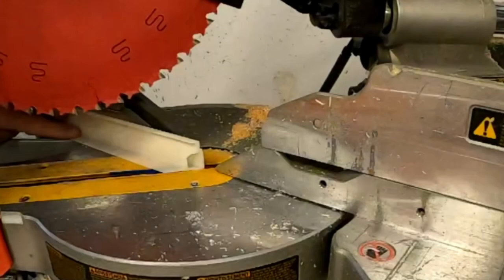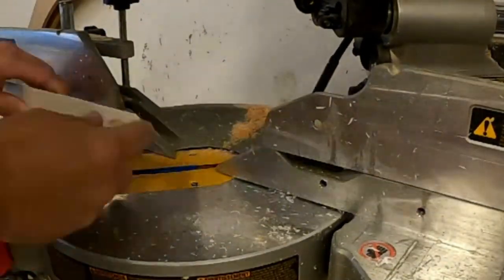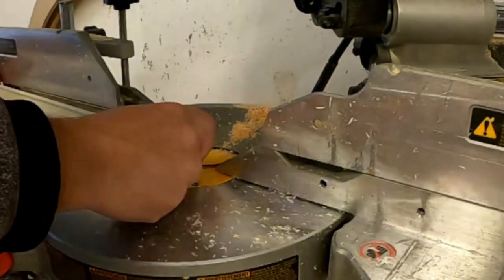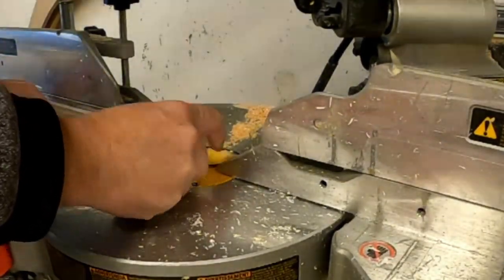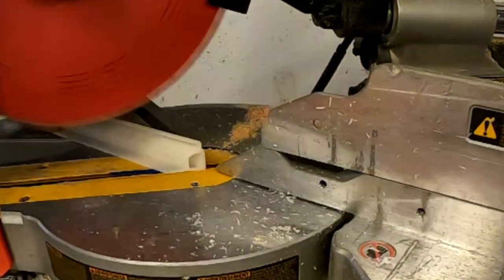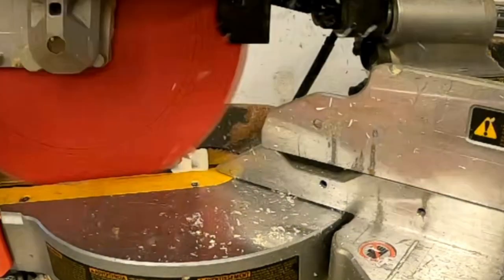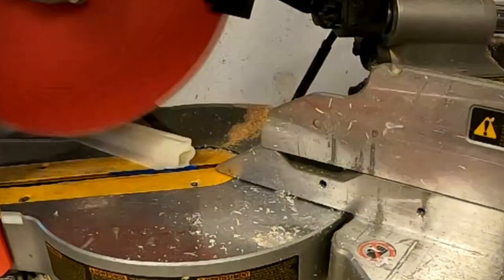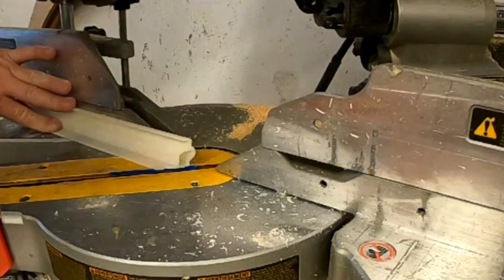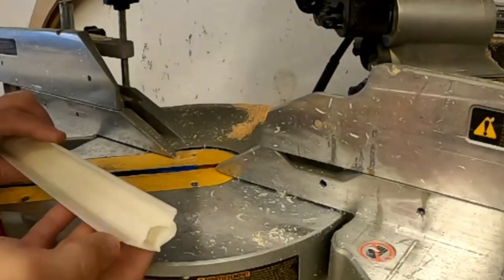Here we're doing a cut on the track — very slow pressure down, and it's making a decent cut. But you've got to be very careful if you're going to use a blade like that. Then here in slow motion, doing the same exact pressure down — no difference — and you can see how it just explodes. The bigger teeth catch the track and it just kind of blows away. Right there you saw the top chip off, bottom chip off, and you've got yourself a terrible cut. Not only that, if you're in your shop, you've got pieces of plastic just flying all over — it's going to hit you. So definitely don't use a rough cut blade for that.